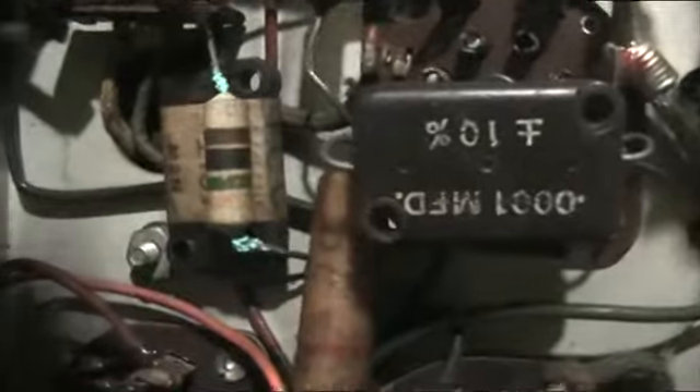There's a prime example — there's a bit of corrosion there. Looks like a 1 meg. Later on I'll write down a list of the cap values that are in here, especially that can capacitor. I can use my homemade ESR meter — it's not really accurately calibrated but it will give me an idea of whether the capacitor is dried out.